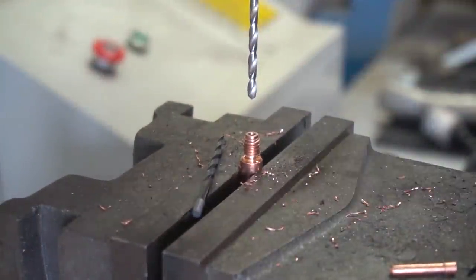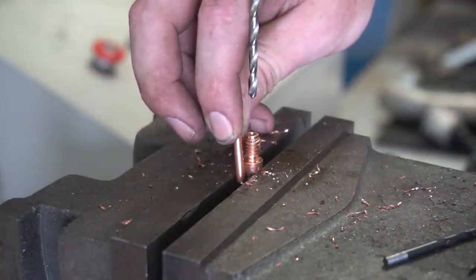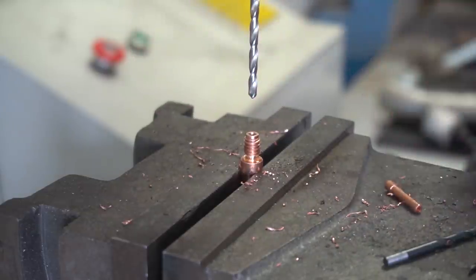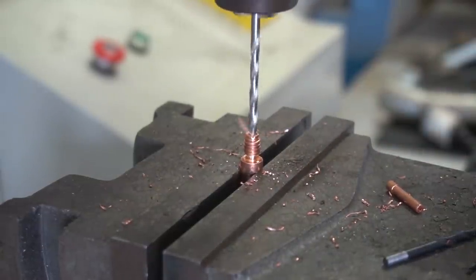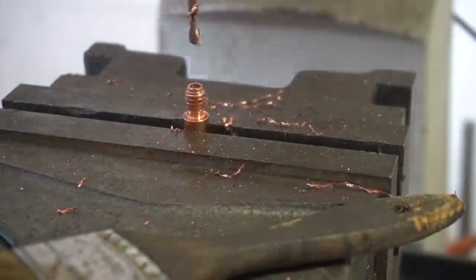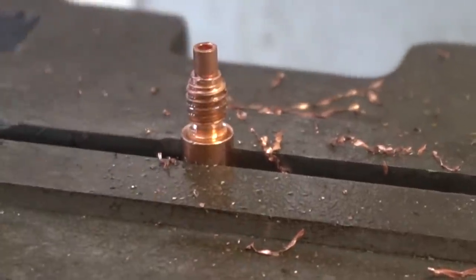As soon as I have the bore for the tungsten drilled all the way through, I'm going to start working on the collet. I need the depth of the collet to go all the way down, with the exception of the shoulder — the shoulder needs to stay just above that top section where the threads are. I'm going to just kind of eyeball it, and there's a reason why, which I'll show you in just a second. Take your dear sweet time, a good amount of lubricant, clean the flutes well, and as soon as you have it finished, you should have something that looks just like this. Notice the shoulder of the collet is just above that thread.